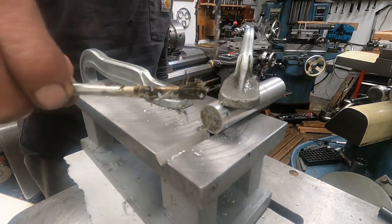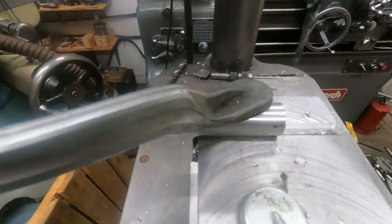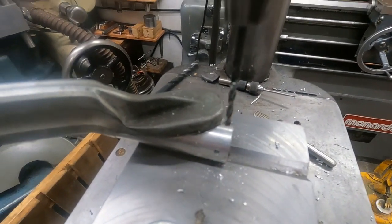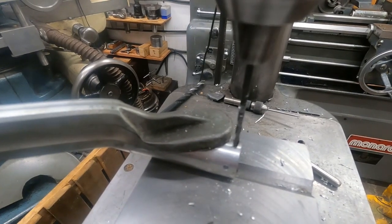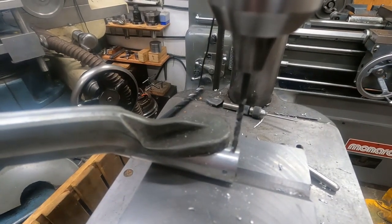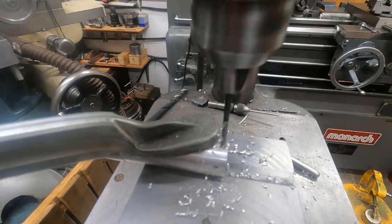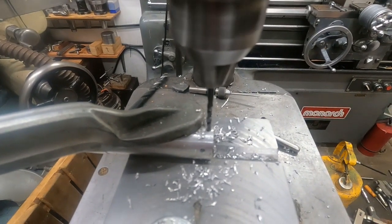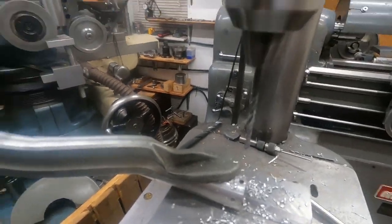Now this drill press isn't an expensive one — it's a little bit crooked. Let's see if we get a straight hole. I'm just going to touch it; I'm not using a center drill or anything. See that? The bit actually straightened out if you just barely touch it. I'm going to be intersecting some holes here — I think I'm going off to the side of it. I would go all the way through it. Isn't that slick? Very handy.